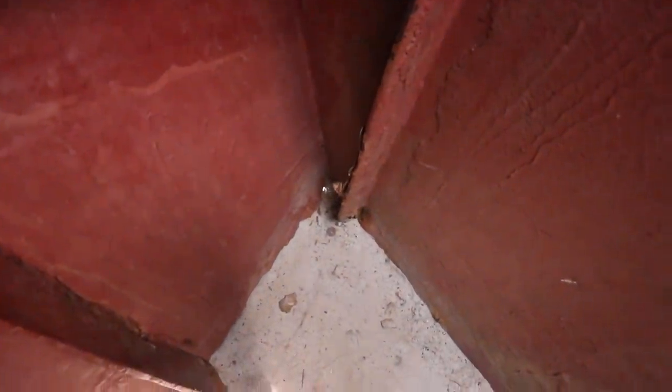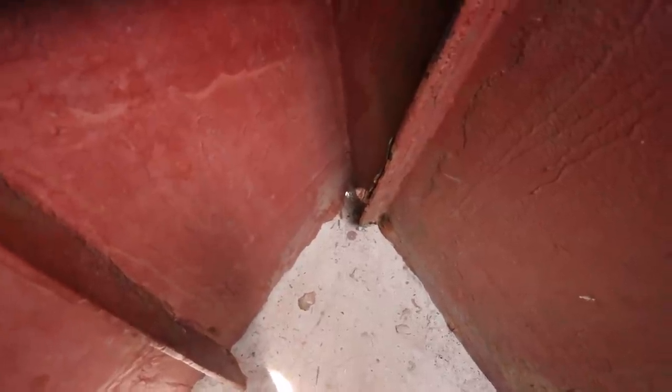You see there's a weld line all the way along there. That's a previous cut that I put into this floor, and check this under the floor here. I didn't see the rust over on the very top corner there. It was my mistake. I should have looked harder. Basically what we need to do is cut that out in the corner so I can use that as a drain hole. I'm then going to hose out all of this sand, and then we're going to chop this floor out so we can climb inside the crash bulkhead at the front end of the boat.